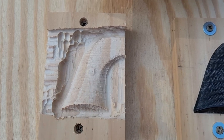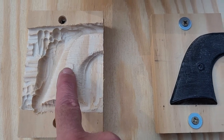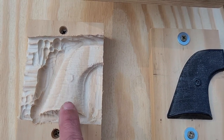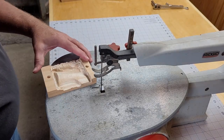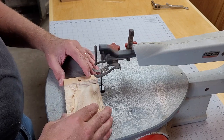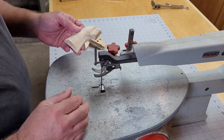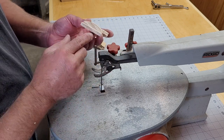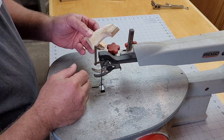I'm going to get this thing out of here and get it trimmed up and see if I can't do a little sanding and shaping on it, see if I can't get it to look halfway decent. You can see that where the screw goes on the original there, it actually shows up in there. But I don't want that on there because I want these to appear to be one-piece grips, and that's easy to just sand off. I've got my antique rigid scroll saw out here. This thing trimmed up. Got a lot of shaping to do on it. The thickness is going to be way more than what it's supposed to be, but I can always hit that on my disc sander and thin it down a little bit.